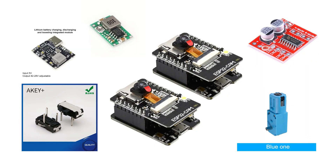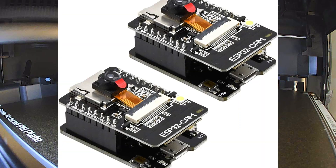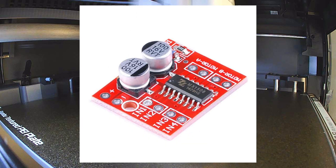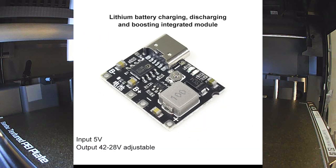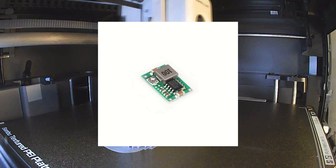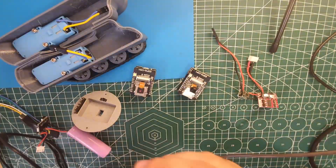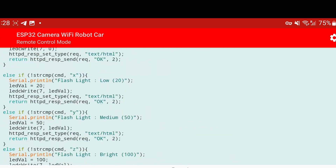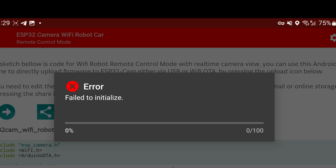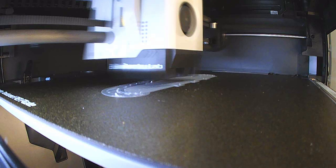First, let's take a look at the components I used for this build. We've got two Arduino TT motors, an ESP32 camera board, an MX1508 motor driver, a 18650 lithium-ion battery, a charging module for a voltage boost to 7.2 volts, and a step-down module to provide 5 volts for the ESP32. To control this beast, I found an Android app on Google Play that connects via Wi-Fi to the ESP32 — the ESP32 Camera Wi-Fi Robot Car app — which simplifies the process by allowing me to upload code directly from my phone, eliminating the need for a laptop or PC.